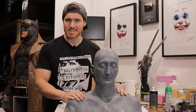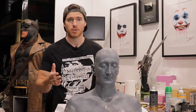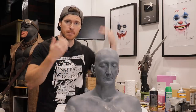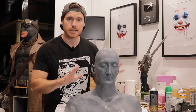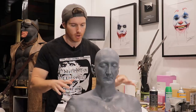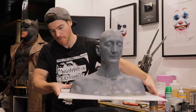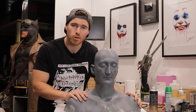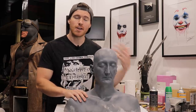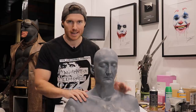The casting had seen some definite wear and tear and had just been knocked about quite a bit from being put in storage and then brought back out to the workshop. So I've gone ahead, cleaned it up, cleaned up any cracks, and have permanently fixed it down to this styrofoam base. Today's video is all about taking a silicone mold of it, and we're also going to create what's called a clay pour or a clay casting.